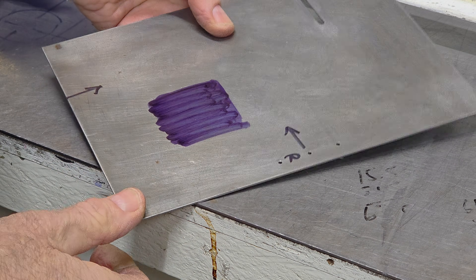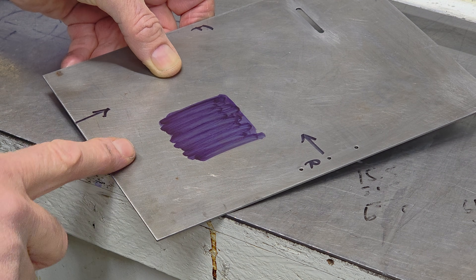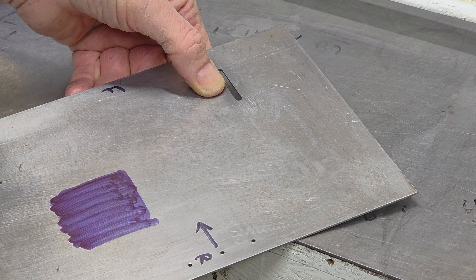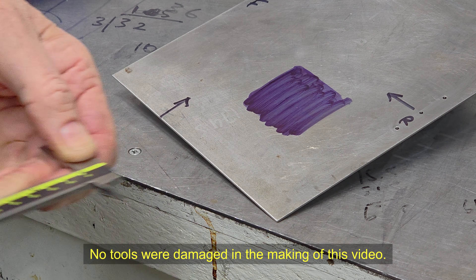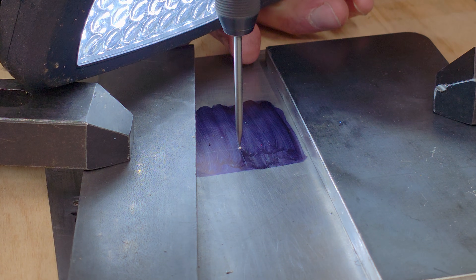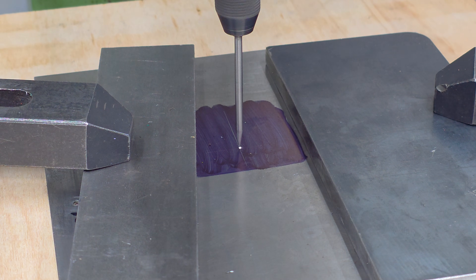I've removed the running board from the frames and applied some Sharpie in the general area where the hole will be. A simple check — easy to forget — is making sure I'm drilling on the correct side of the running board. This is the rear, left side; the front edge is here, and the slot for the reverser is positioned the same way. I'm looking at 73.5mm from the rear and 77mm from the side. I'll centre punch that and drill it. Because the running board is quite thin at 1.5mm, I'll plunge straight through with a slot drill for a better finish, using a wiggler with a pointer to find the centre accurately.